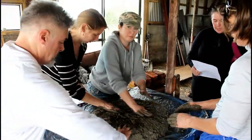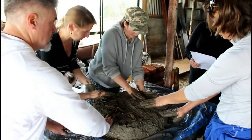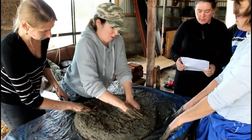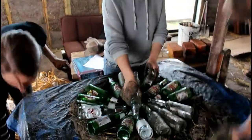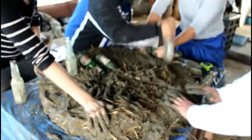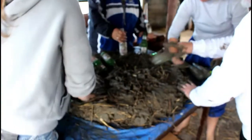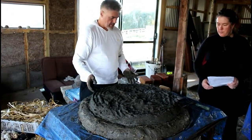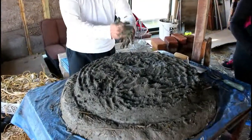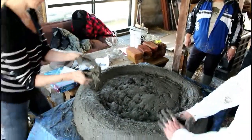It's a bit of playing around with different subsoils and different clays to get the right composition for cob. What's generally a good idea is to find a nice clay — this one's quite high in clay, so I could use this as my clay slurry, mixed up in water, so that you've got just the pure clay element. Then you can mix that clay in with your subsoil in different ratios. You might find that three parts subsoil to one part clay gives you a nice ball that holds together well, or you might need more or less clay — it's just a matter of finding the right balance.